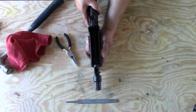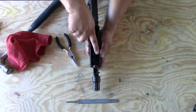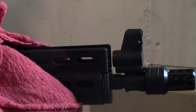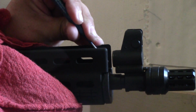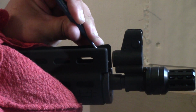To finish this now, I'm going to bring this back out onto the vise in the garage with the punch and hammer, and I'm going to push that lever all the way forward with a punch and a hammer again. Okay, I've got the M92 back out in the vise, and so now I'm going to go ahead and with my punch and hammer tap that forearm retainer lever back in its forward position.